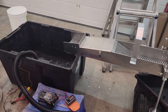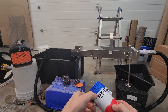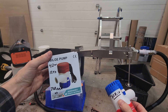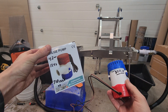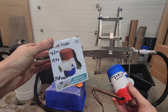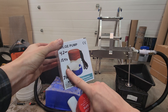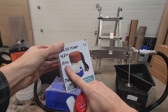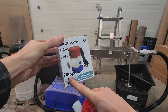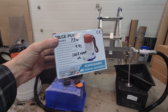So let's get to the numbers. This pump right here, which was $28 shipped to your door — I'll put a link in the description below — this bilge pump only used 42 watts. My old broken one used over 50 watts, so it was either wearing out or this is just a better pump. This one also seems to be putting out — it filled the bucket on average in 13.4 seconds to fill 10 liters. I calculated that out as 710 US gallons per hour. So slightly more efficient: less power used, more water moved.